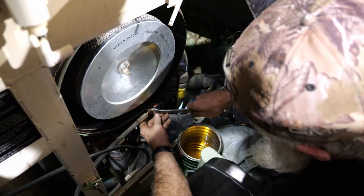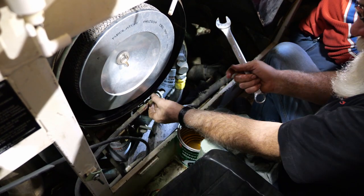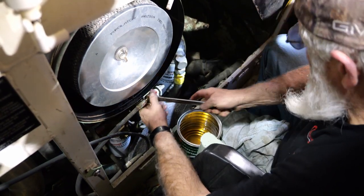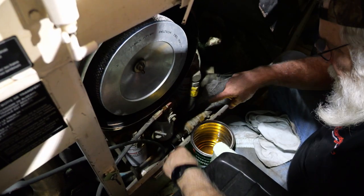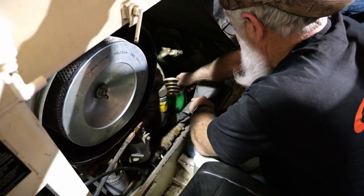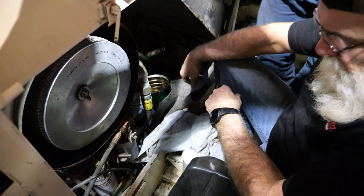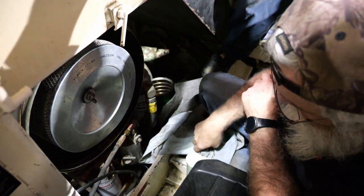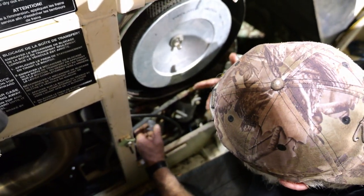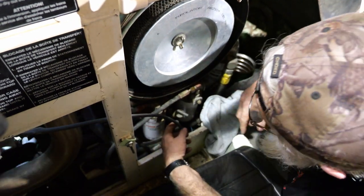There's a really good flow there. Now, from here it goes to the fuel pump — mechanical — and then back to the secondary. Let's see if we can get off to the secondary. Pop one of the lines off it. If we get the inlet line to the secondary off, we'll do the same test with it.